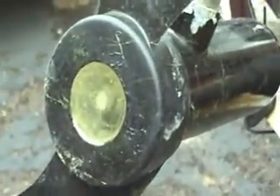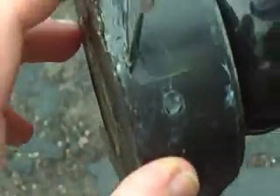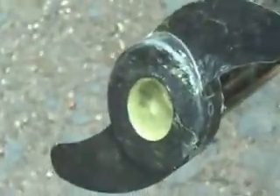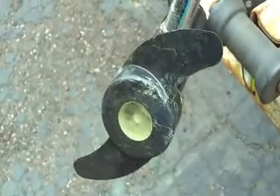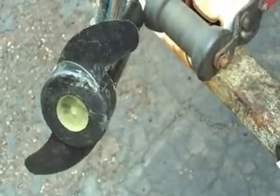Now that the light is a little better, I'll go ahead and show you the new prop. It looks greenish because I ended up running into some seaweed and algae — all manner of disgusting sea life type stuff that's not supposed to be on a motor. Basically this hole here is what I ended up modifying — I drilled that through, filled it with epoxy, and I tapped the motor shaft so that it would accept a hex head bolt, so I could use an Allen key in there. That was pretty sweet.